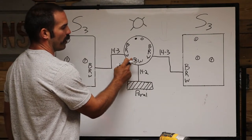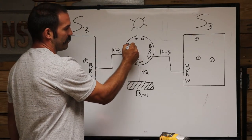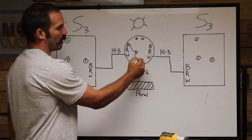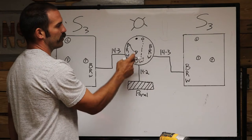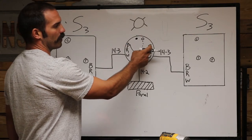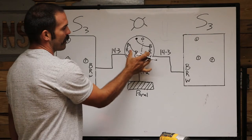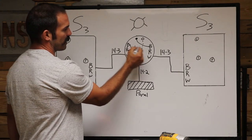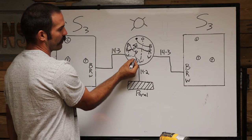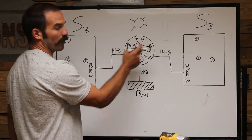For our first hot wire, we are going to attach it to this black wire going into this switch. It does not matter which black wire you attach it to. The next one is my white wire, which is my neutral wire — it is going to attach to the silver terminal of the light. The black wire going to that three-way switch is going to be the switch leg, so it will attach to the gold terminal of the light. We have our traveler wires left, which are our reds and whites — just remember that our reds and our whites are travelers.